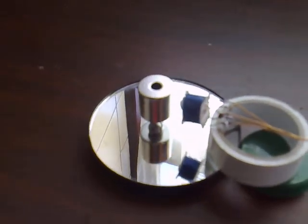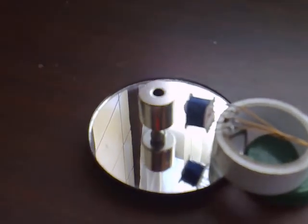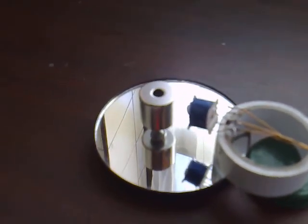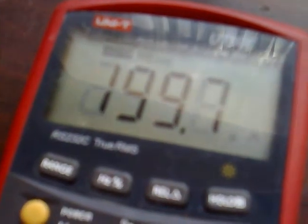But basically the idea about building this motor was to get one which runs on microamps. Now Lid Motor did that with his Bob Bedini motor and I tried replicating that and I can only get it to draw six milliamps. I found these small transformers at the local electronics shop, which is Maplins in the UK, and I bought two of them — a red one and a blue one. Now the red one doesn't work but the blue one does — it's an LT44 audio transformer — and the current draw for this motor is absolutely minuscule.